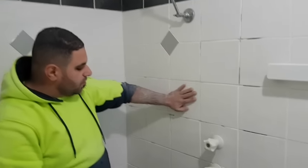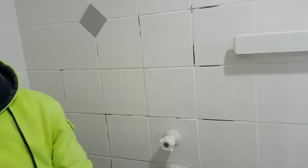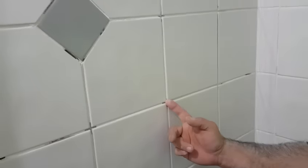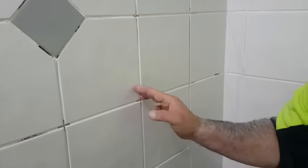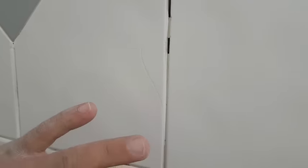Richard here again from Yes I Can Handyman — we've taken all the old grout out. We did find some really soft spots, and however this was tiled it left spaces close to the edge, so we took as much of that off as possible. You have to be very careful when you run over these spots with the machine as it generally jumps out. I accidentally scratched a little bit here but it will be very unnoticeable once I finish the grouting process. Now, what you are going to need for grouting...